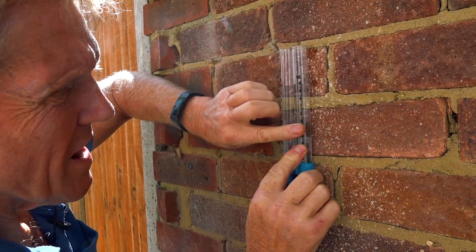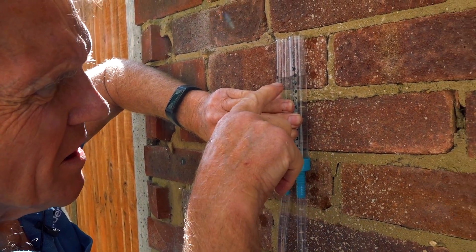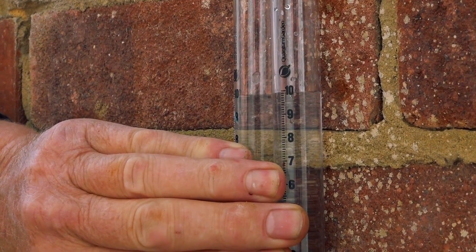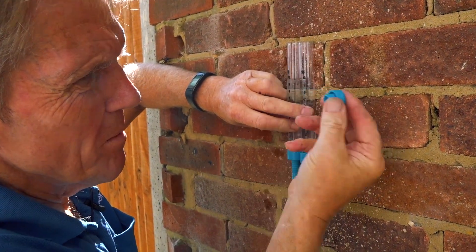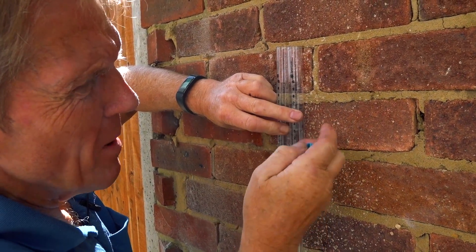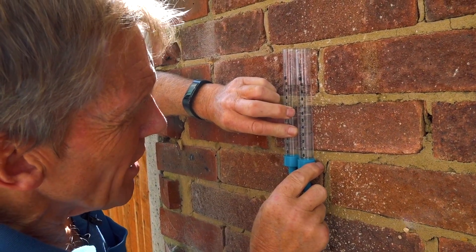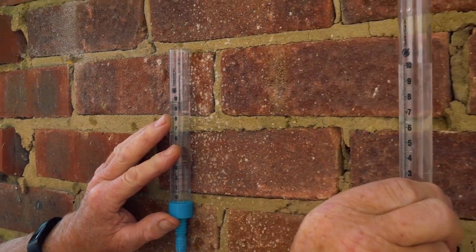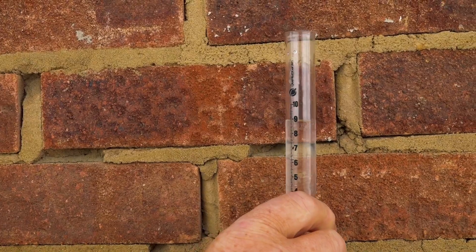You can see that once you get the air out of it, just give the hoses a little bit of a shake to make sure there's no trapped air in there, and you can see that the water finds its own level — that's basically the principle we're working on. I've taken the tops off to release the air, and when you're doing the measuring you don't want those tops in because you're pushing against air, but when you're carrying it around you want to put the tops back in. So you can see we've got a perfectly accurate level there — we can fix one on one point and carry the other one to wherever we want and it will continue to be level.